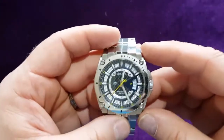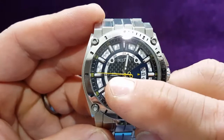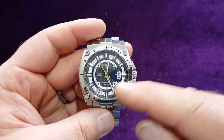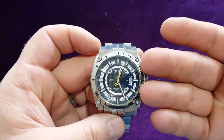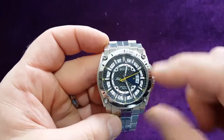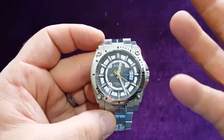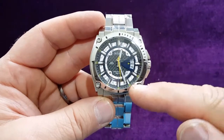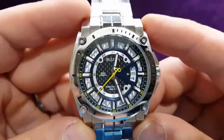In regular Earth conditions, this is the best you can have from quartz. As you can see, this is a really nice sweep motion. Actually every quartz movement can do that because inside there's a step motor which is regulated and commanded by an electronic microchip, and the microchip takes the signal from the quartz oscillator. The reason ordinary quartz movements tick every second is to save energy — they can have a battery life of three to five years. This one only lasts one year, but I don't care. It's 300 meters waterproof and it's a beautiful watch.